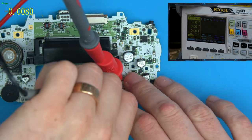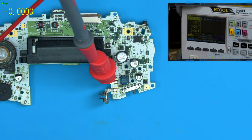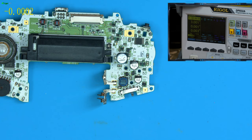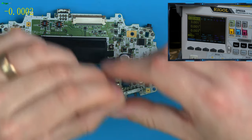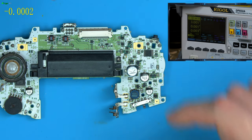But if you experience or see that issue, then you should understand that the R13 resistor is what is discharging your Game Boy when you turn it off. So if you're experiencing issues where you turn your console off and on again fast and it fails to boot, this is common between most Game Boys, you'll find that there's a discharge resistor that basically drains the system power faster so that it can start up again. So let's just pull the scope in and get this resistor on.